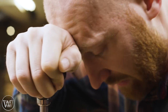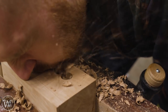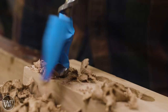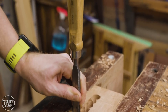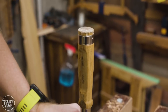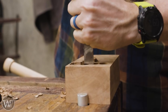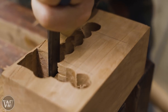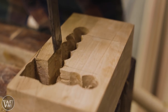I need to create a very large mortise in the back of this for the electronics to fit down into. For most of the stock removal I'm using a series of auger bits. I put a flag on there to make sure the tip of the auger bit does not come out the other side — I want to leave at least an eighth of an inch between the tip and the outside. Then I can take a chisel and square out the mortise so the electronics can fit all the way down into the slot.